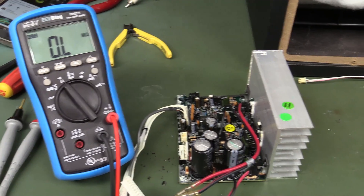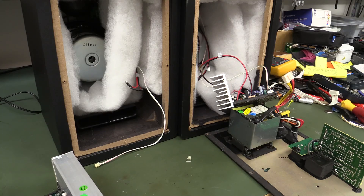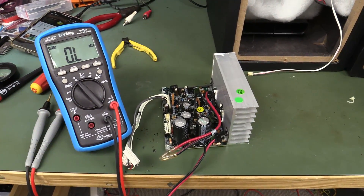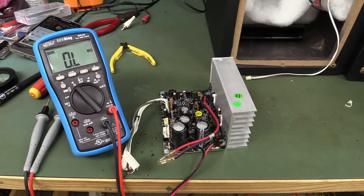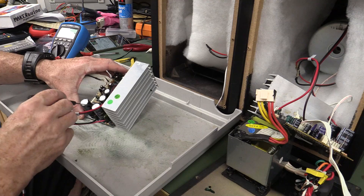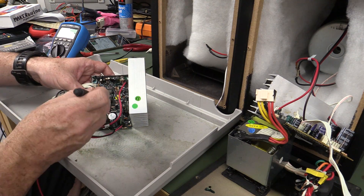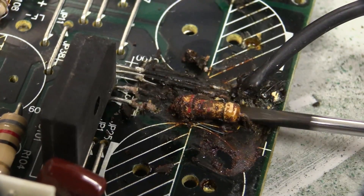KRK Systems did so well designing everything else — the excellent sealing, the properly designed acoustic enclosures, the drivers — but it doesn't matter diddly squat if you screw up some basic electronic stuff like using quality caps and a reputable brand potting compound. Any reputable brand potting compound wouldn't have done this. I'll go in there and scrape it off — it gets everywhere, just crumbles, so definitely do it in some sort of tray because it's going to make a mess. The good thing is it's a single-sided board, so you don't have to worry about digging out any tracks.